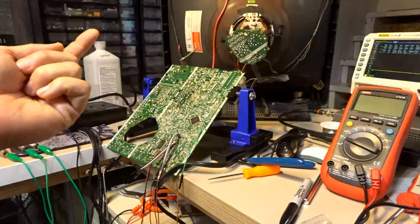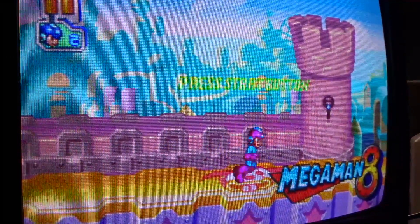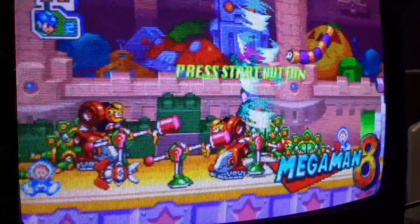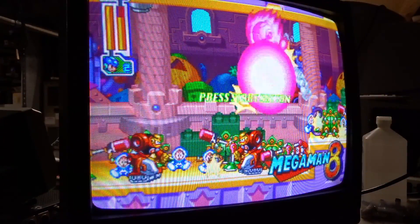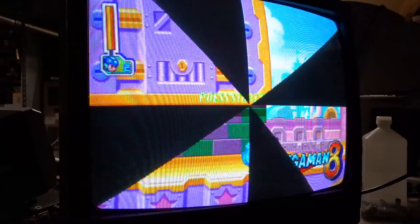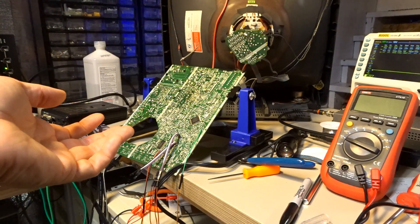There you go. I'd say this is a real trash-to-treasure episode. I was going to throw this away, and I think I'll keep it now. I'm just going to modify the case, add the RCA jacks, add the toggle switches to switch between composite, RGB, and the on-screen displays. But I'm shocked — this works better than I had ever hoped. I've seen other people do RGB mods — there's lots of people doing them on YouTube — and they don't always work so great. You get weird graphics that are overblown, or you have sync issues. This one, at least with the PlayStation, zero issues. Anyway, if you thought this was useful or interesting, give me a thumbs up. Put your comments and questions in the comment section below. I'm shocked. And that's it. Thanks for watching. Bye.